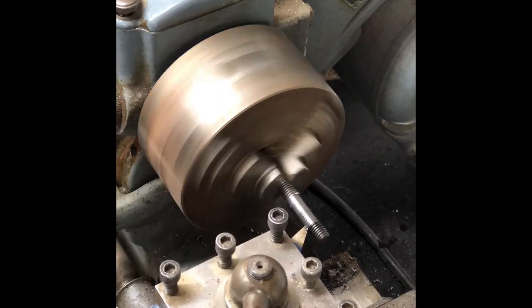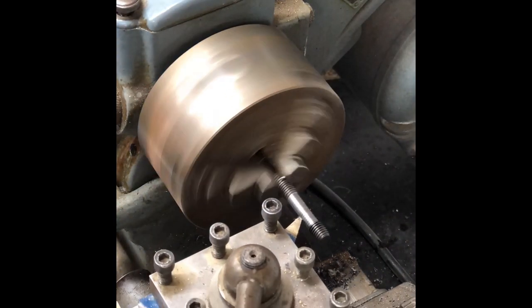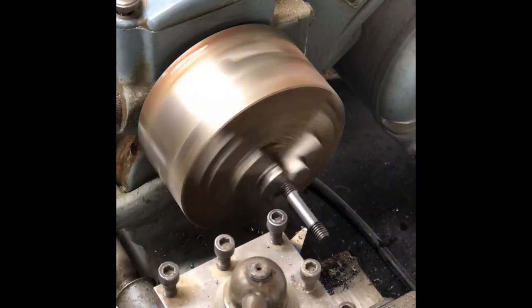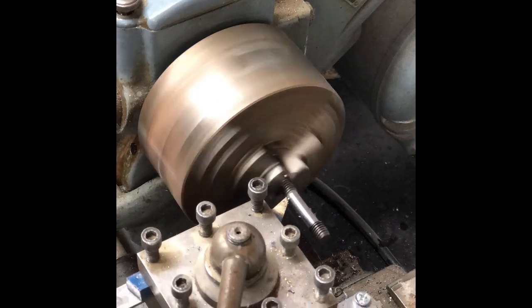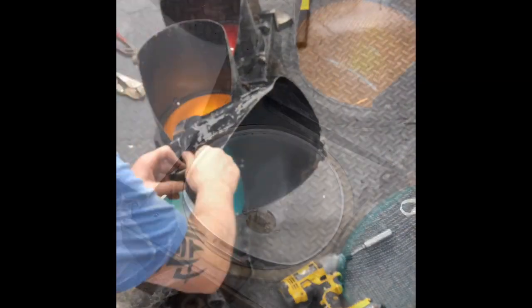At this stage, I'd found a manifold bolt and started to turn it on the lathe to thin it out. I left a small amount of thread on the end and drilled a hole in the actual piece I'm going to be making, which comes along a little bit further on in the video, and then decided to weld it into the end and then bend it, which you'll see in a minute.